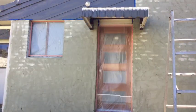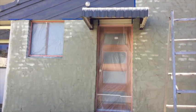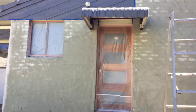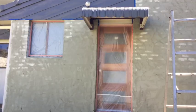If you see the render drying through the day, it's a good idea to give it a light hose — just a light mist to keep the moisture in the render to help the hydration process. Quite often that can be done before you go home of an evening.